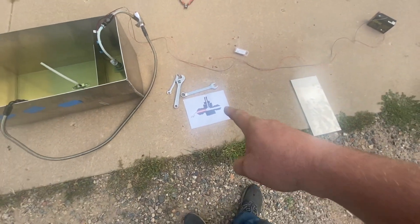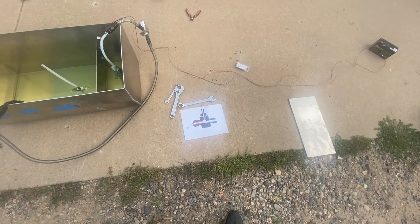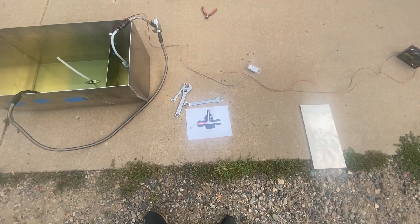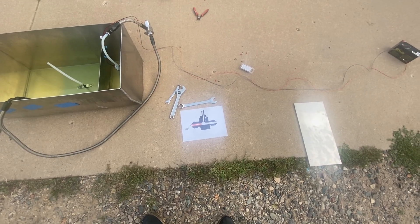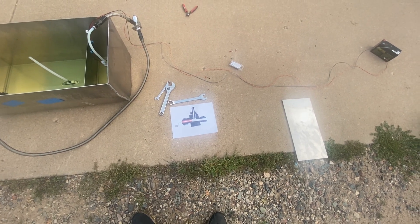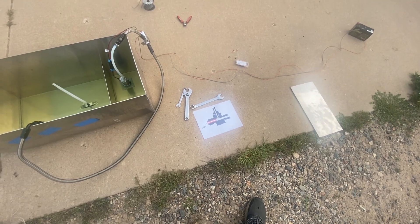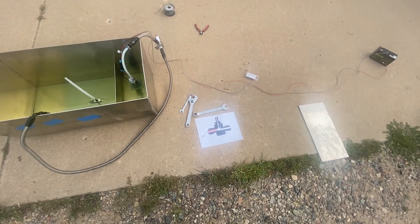To make the jet, I took a piece of brass rod in my lathe and machined it so that it was an interference fit into that fitting, then drilled a 156 thousandths hole through the center of it, and tapped it into that fitting with a hammer so it's just a light press fit.